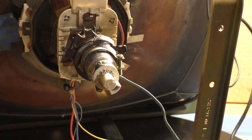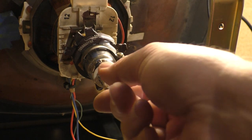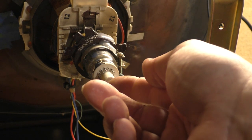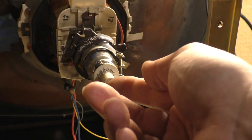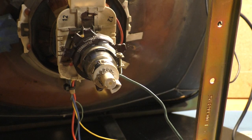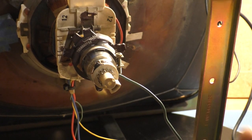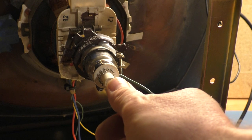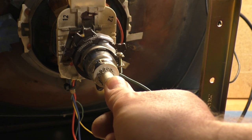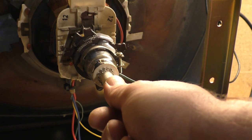So now what we need to do is, I'm not going to actually put the RTV on here yet because it takes hours for it to set up. So what I want to do is just leave it like this, plug the neck board on, get a chassis on here, and then solder this to the back of the neck and make sure it works. If it does, then I'll toss the RTV in there and put some type of tape on here or something to hold it flat so it dries. You'll never have to worry about this again.